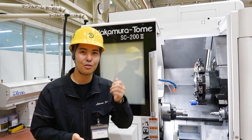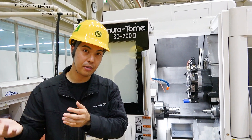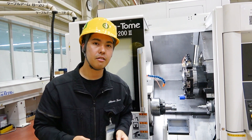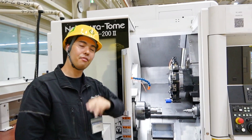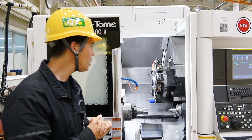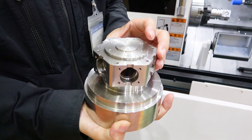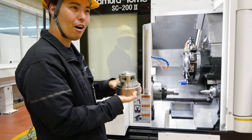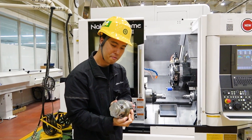The third benefit is permanent tooling. Permanent tooling means you put many tools for several types of workpieces. Normally, if you exchange the workpiece, you also need to exchange tooling. But with permanent tooling, you don't need to do that — it reduces human interruption for the machine, making it very easy to use. Also, this turret has X, Y, Z axes and a milling rotation axis, so you can use multi-axis machining. For example, this is a mini turret workpiece — made by this machine. It means the turret makes the turret. It's interesting, isn't it?